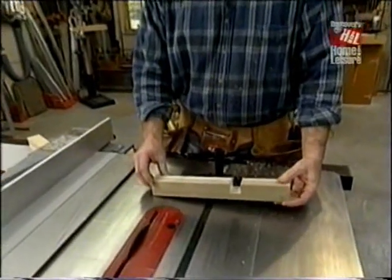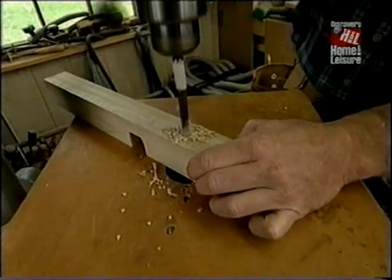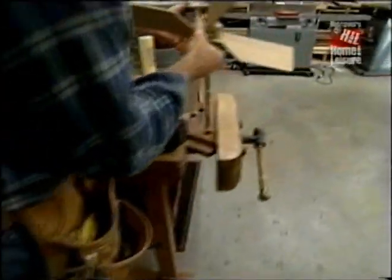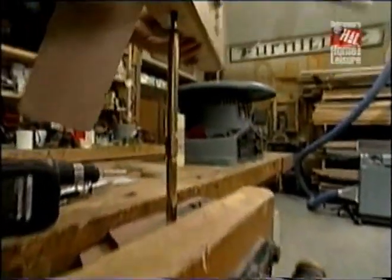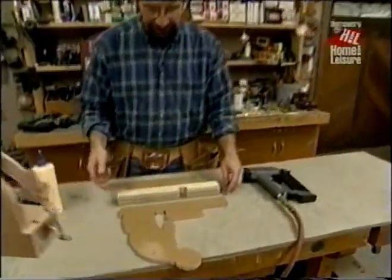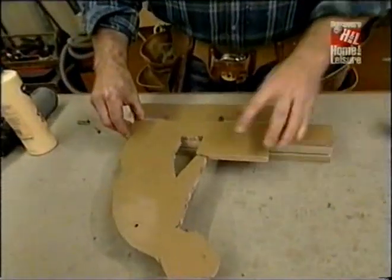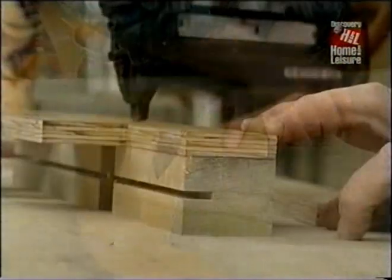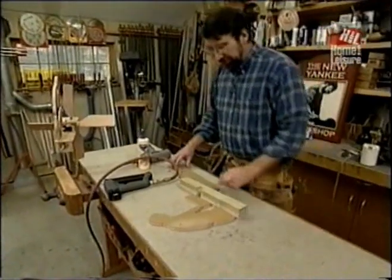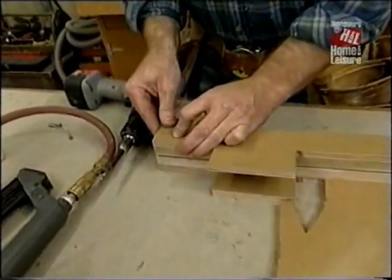This piece of poplar will be sandwiched between the plywood sides. I need a groove down the center for the drive shaft — two passes through the saw will take care of that. That slot is necessary for the pulley that will drive the saw. That hole is for the post which will allow the whirligig to spin into the wind.